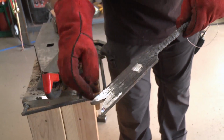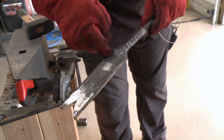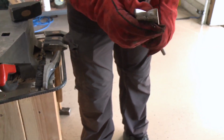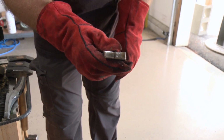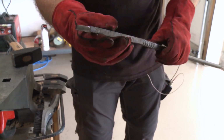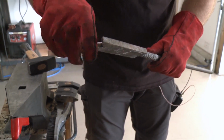This is what it looks like after things have been welded together. So you can see we've got gaps, what it looks like on the surface, but look at the end here. See how it's solid in the middle? So that's actually fused all solid throughout the billet. And so this is an alternative to the tip technique that Owen used in his clay demonstration,